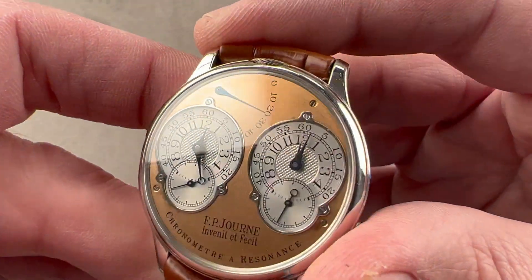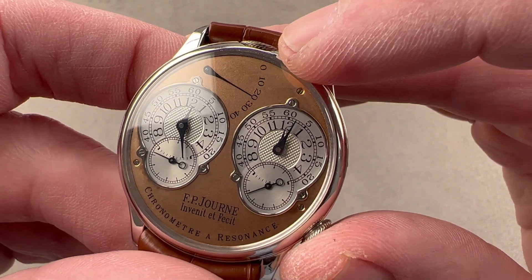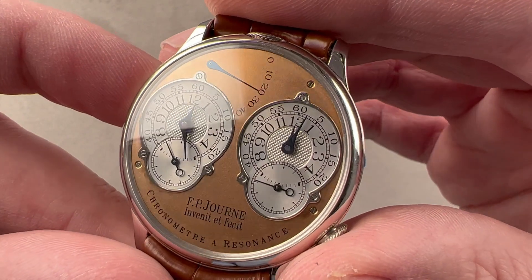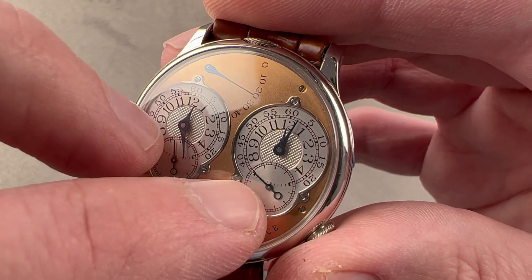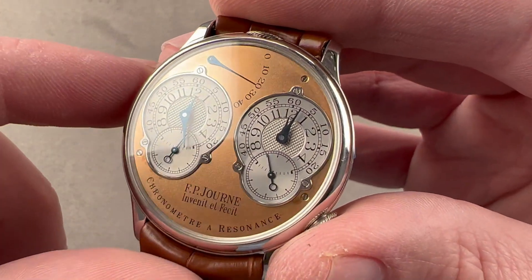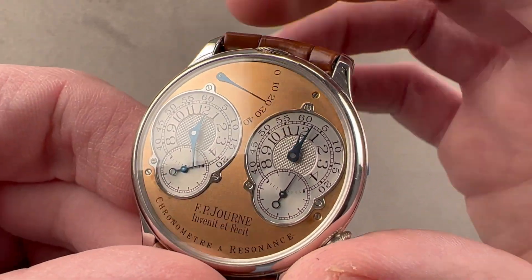The watch has a power reserve indicator that, like a marine chronometer, moves backward — it indicates the hours since fully wound. At full wind, it indicates zero hours since fully wound. You have one power reserve indicator for both sides of the movement; power reserve for both sides is 42 hours. Now, we have two independent dials — it's not really a dual-time watch, that's not its mission, but it works as one. You can set both sides independently. It takes about seven to ten minutes for resonance to get a grasp on the watch and actually couple the two sides, so the seconds hands might not be synchronized.